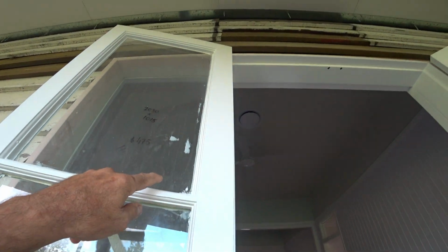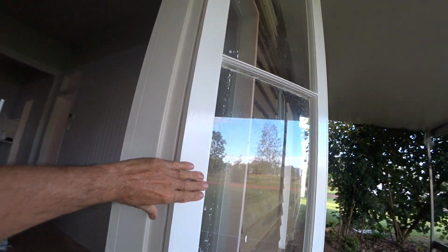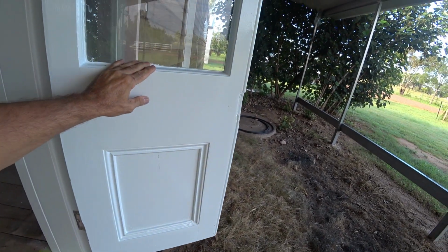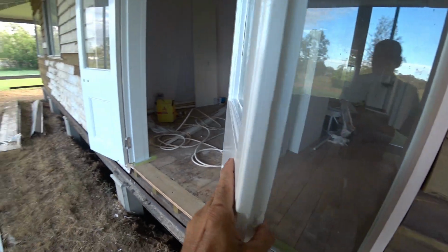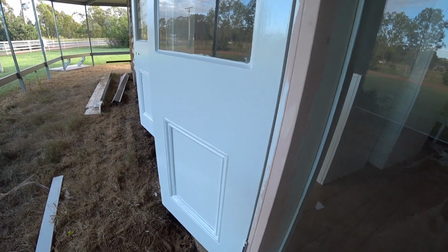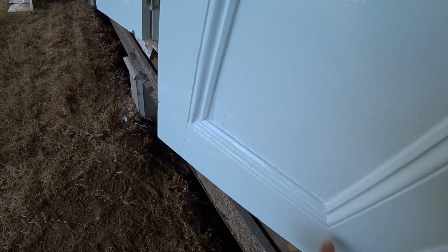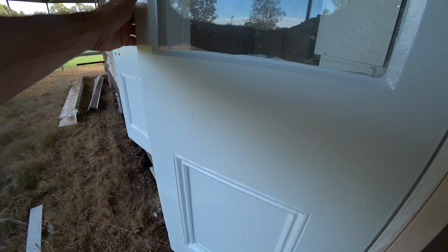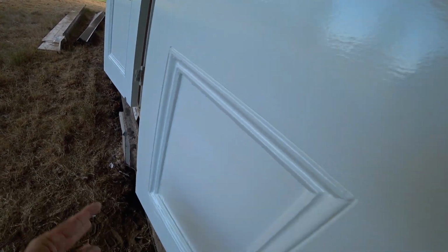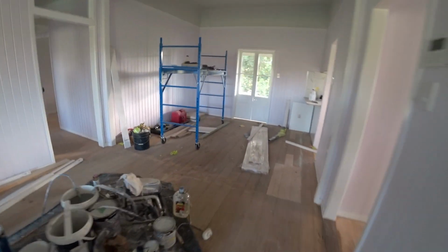So we'll clean up these bits and pieces. So I'll show another one. I mean, we could go another layer now. Remember, that's only one coat of gloss enamel, one oil undercoat, one undercoat basically with the water-based enamel, and then one gloss enamel. So there was a lot of damage and around stuff you couldn't fix. But that's it, I'm happy with that. I mean, you could go to the next layer now. What we could do is actually fix anything else that we could see. But these are old doors, it's an old house, and that's basically, you know, something very, very nice there now.